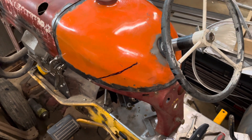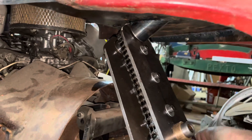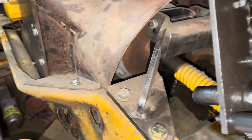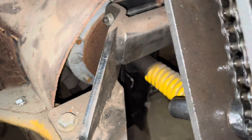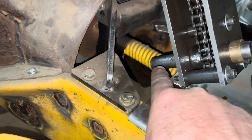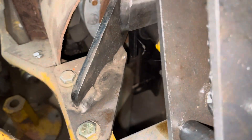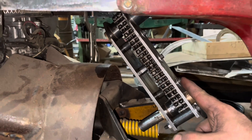Here we are at the tractor. You can see where our steering shaft came through the fuel tank and how we have offset it back and to the side. We can shoot right down through that gap with our universal joint, giving us plenty of clearance to put our steering in. We'll just need to put a tab from here down to this plate to help support it and keep it from wanting to turn. Then we can use a universal right off of this down to a steering box below the engine. It was all thanks to the chain driven offset steering box.